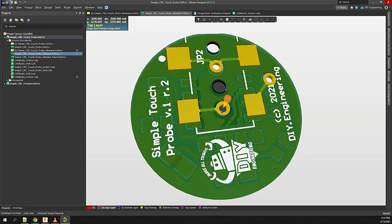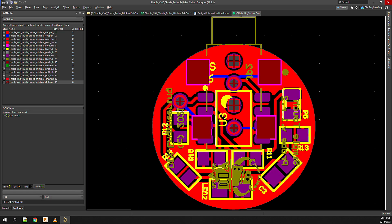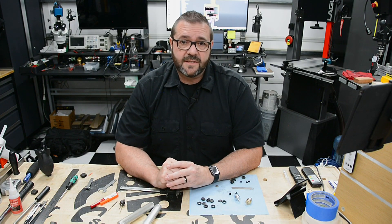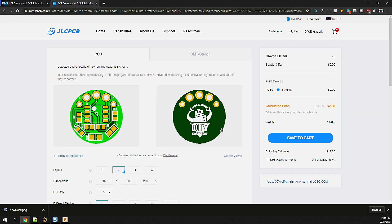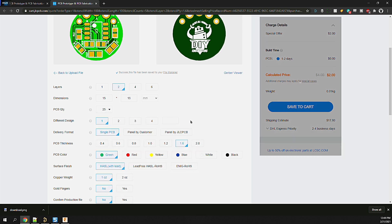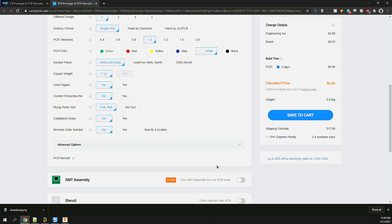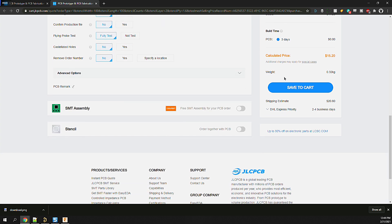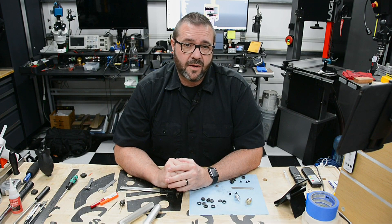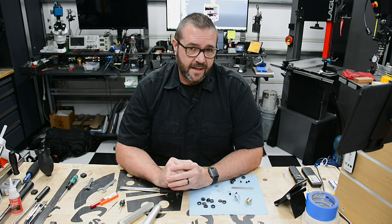Back to the project: in Altium I updated the board design to incorporate the new headphone jack, ran a design rules check, and generated the manufacturing Gerber files. For fabrication I use my go-to board house, JLC PCB. I head over to jlcpcb.com and drag the Gerber zip file onto the order form - it's uploaded and a preview is rendered. You select the quantity, color, and finish and you're good to go. In this case we're going with a thin one millimeter board and having them panelize the small boards to simplify assembly. I submit the order - that's going to take about a week.